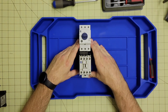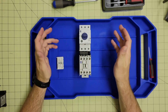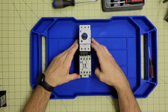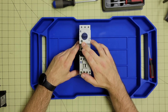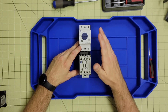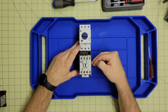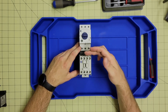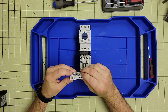This setup is used for protecting a standard three-phase or single-phase induction motor. Common applications in my experience include a spindle on a CNC machine or a motor driving a conveyor. You size the thermal overload based on the full load amperage rating on the motor nameplate, find something within that adjustability range, and set it to the correct amperage. Same thing with the contactor — select one rated for the motor's amperage. The ECO blocks are tested to work together, so you can find one rated for the max current draw in the system.